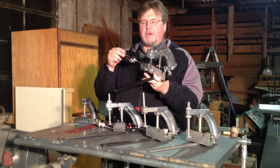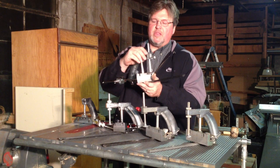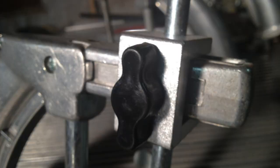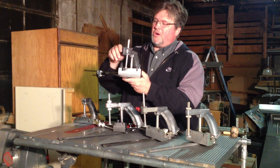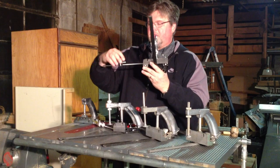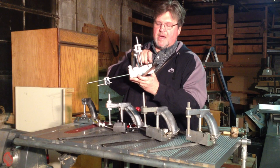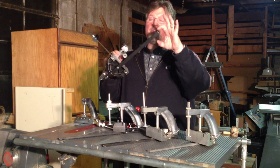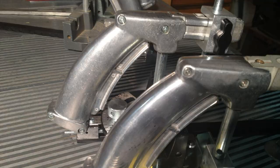Then I found this miter gauge — thought I'd go ahead and complete my obsession. I bought this one online; it was available on eBay. It's a little more faithful to the current model of the ShopSmith miter gauge in that they did knock off the quick clamp. One of my problems with it, though, is that the bolt is pressing against an aluminum casting, where on the ShopSmith this is powdered steel — so in the long run, that concerns me a bit. But otherwise it's pretty faithful to the original: it has nylon glides, a miter stop rod that runs through the center of the casting. However, there's no T-slot washer or expansion, so I can't lock it in place. And of all the miter gauges I've played with, this one has the roughest finish, so you might have to polish it up a little bit.